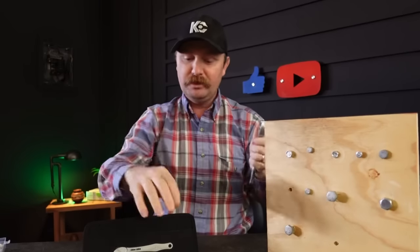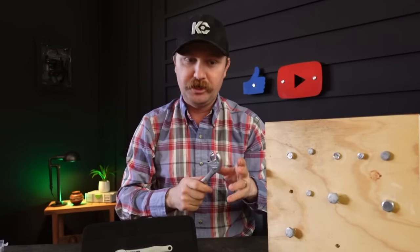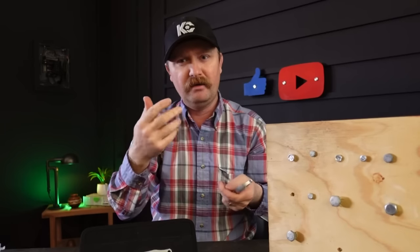These sit somewhere between the pliers wrench and an adjustable wrench. They're a whole lot faster than an adjustable wrench — the resetting is very quick, and you don't have to worry about losing the setting. You know how with an adjustable wrench, the worm gear slowly undoes and each time you use it the head is set for a larger nut? That gets very frustrating — that's pretty much why I eliminated those from my bags.